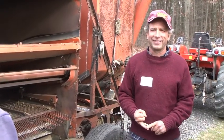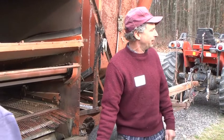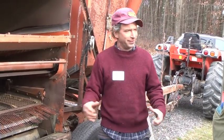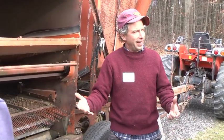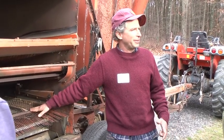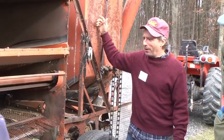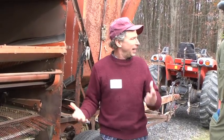A guy that just goes out in a combine and starts driving around is going to do a really bad job. You've got to be checking what's coming out of the tank. You've got to be checking what's coming out onto the ground. What I do when I'm first setting the thing up is I have these 1x1 foot pans that I use, and as my hired man is coming by with the combine, I'll throw that underneath the combine and get a sample of what's coming out of the cleaning shoe. And they have calculations in books determining head width and how many grains per square foot equals how many bushels lost per acre. And from that, you can decide, okay, here's my tank sample, looks like this. Do I want to lose a little bit extra and get a better tank sample? Or do I want to get everything and I'm going to clean it out and I don't care what the sample looks like? It's a balancing act.